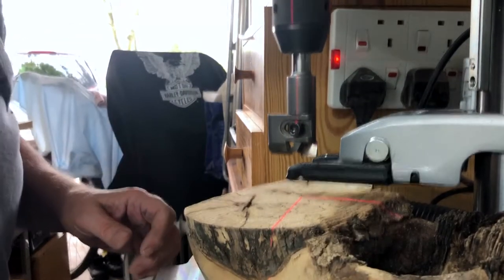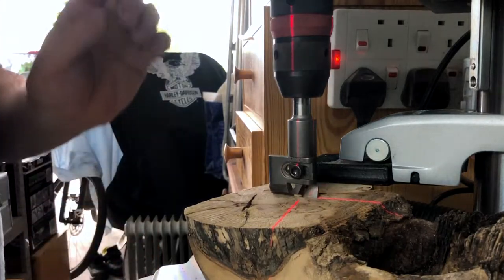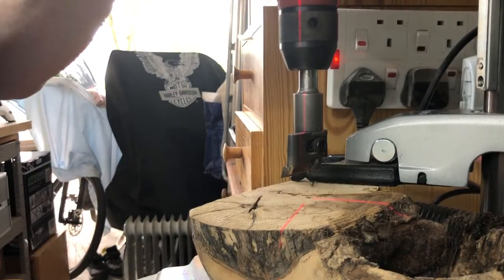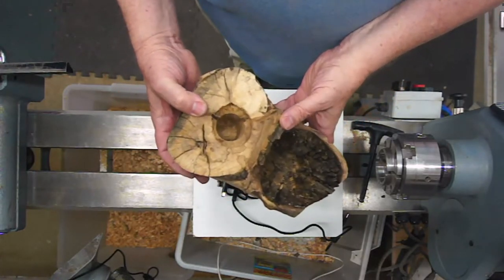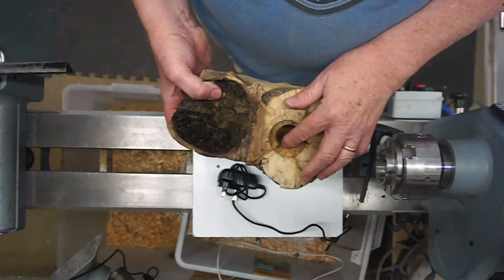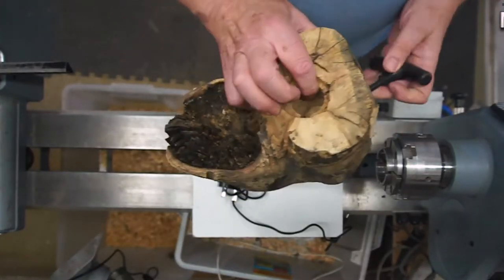Off to the Bosch pillar drill with this rather weird one-legged extension — a bit evil because it's not evenly balanced, but it's the only one I've got that'll do holes up to 60 or 70mm. The workpiece needs to be well gripped, otherwise it'll move. The wood was a bit punky so the hole wasn't particularly perfect — it's ragged out a bit at the top. I also drilled a 35mm hole straight down and stopped it 10mm short at the base, which will allow me to drill the 12mm diameter hole through to the inside.